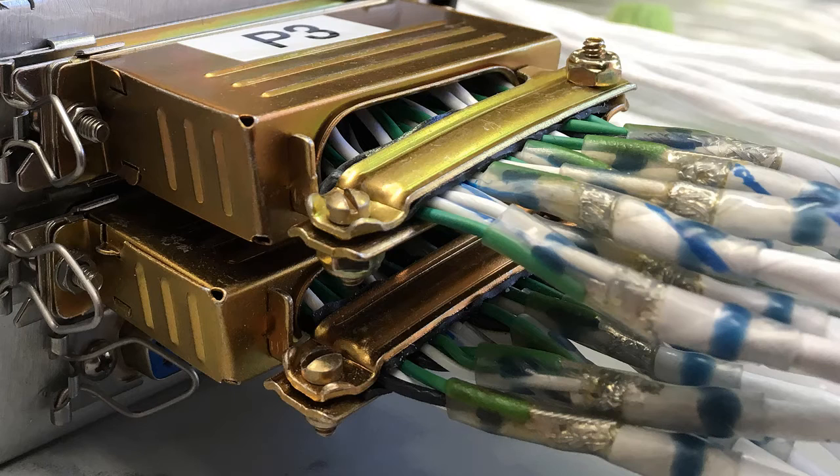For EMI/RFI shielding: with these metal back shells they are shielded, so that's good. Recessed contacts that are scoop-proof — not to the degree of the mil circular connectors. The pins are protected a little bit, but not idiot-proof; you could bend a pin if you scraped it against a protruding screw. I think if you are prudent and select your parts appropriately, they will get the job done.